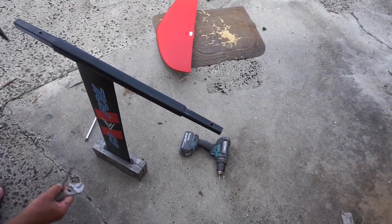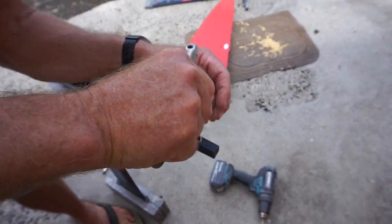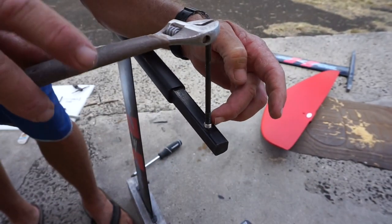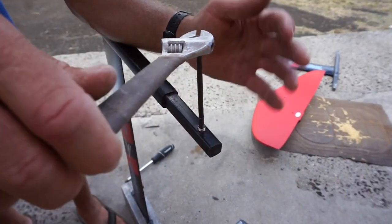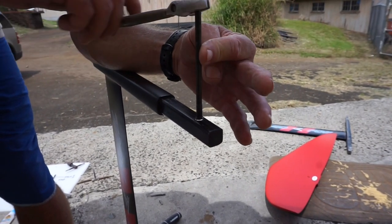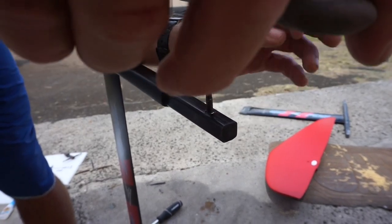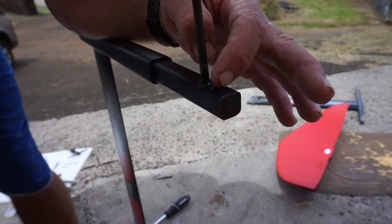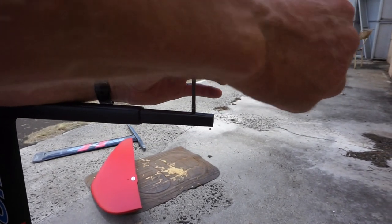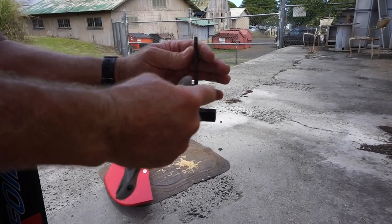We come back, get our helicoil, and get it positioned right on the top of this. Get the crescent wrench — now look, you're starting to thread it in there, see how it's turning? If it doesn't catch in the beginning, you've got to try and re-thread it with your tap again. You want it to go in there nice and smooth with a nice steady pace. See how that helicoil is right at the surface? I want to go two full turns more. So now I'm right at the surface — I've got my crescent wrench in position, so I'm going to go one turn, two turns. Now I know my helicoil is at least two turns below the surface.